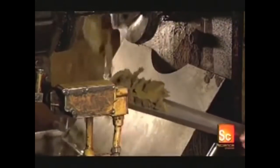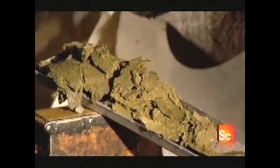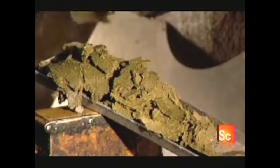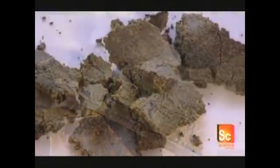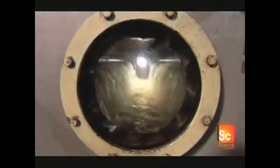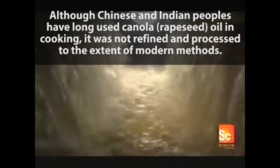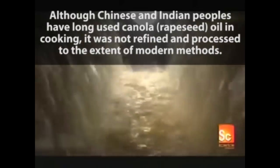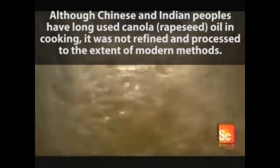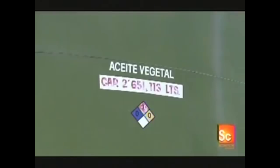The remainder is still trapped in the pressed flakes, now referred to as canola cake. The cake exits the other end of the press and moves on to a second extraction — a 70-minute wash with a solvent. This chemical extraction process removes all but a trace of oil. The factory then grinds the cake into protein-rich meal that it sells as animal feed.